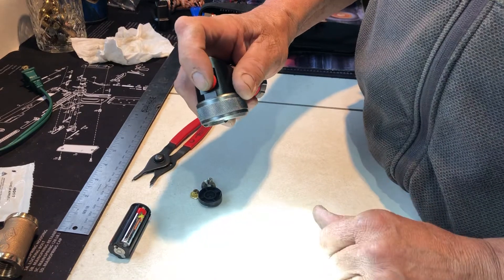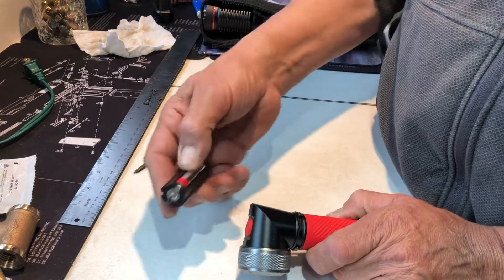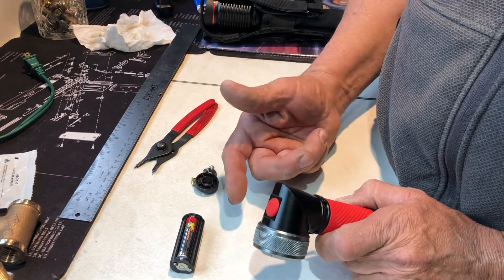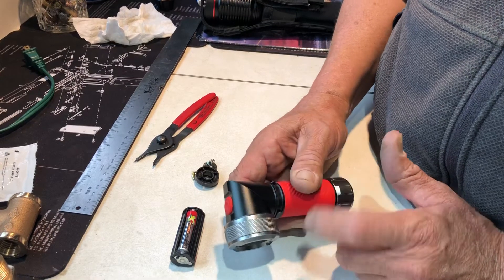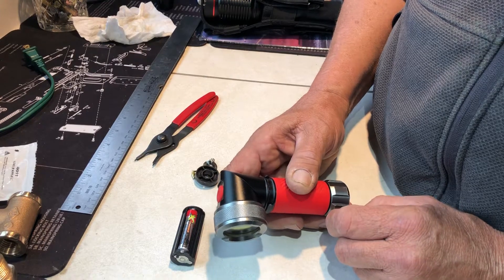It's even a little bit brighter. The batteries are 1.2 volts a piece, so three of them equals 3.6 volts. Now of course if they were alkalines, that would be 1.5 a piece at a total of 4.5 volts, where the 18650 fully charged is 4.2 volts. And it will go down to probably as low as 3 volts before you want to recharge it.